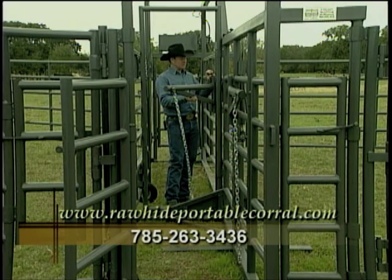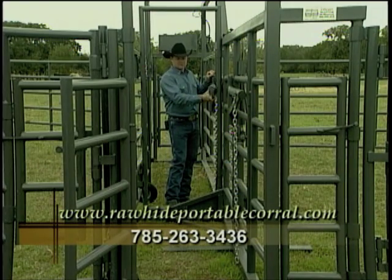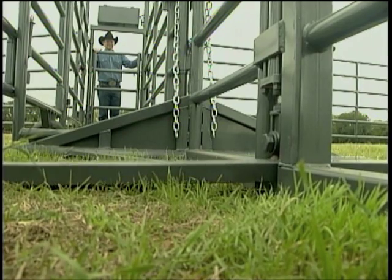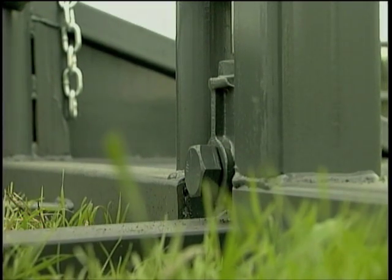The racks unpin with a 1¼-inch cold rolled rod pin. You also want to remember that your cylinder foot is pressed into the ground a little bit, so you don't have something for cattle to get their toes under as they walk through the alley.